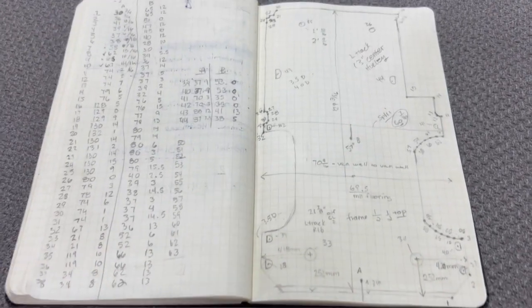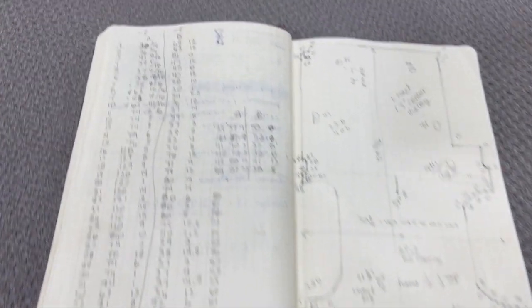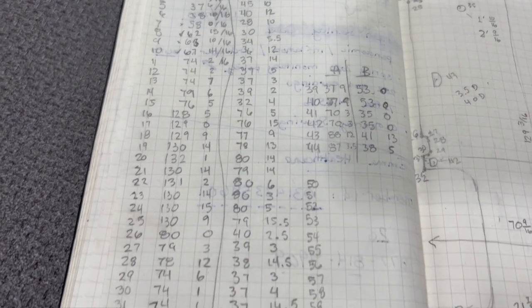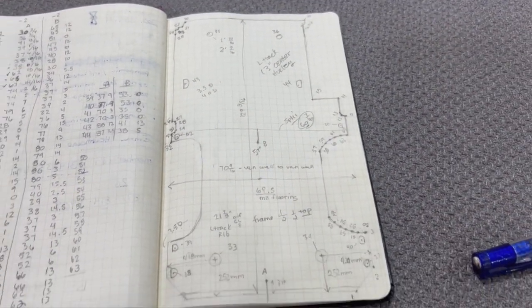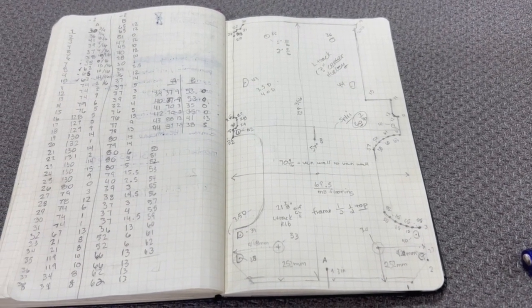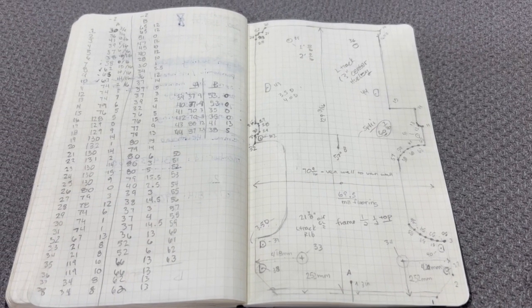Here's the map I made of the flooring to lay it out in CAD. I took a lot of data points — measurements. These are all two inches longer, so I take a couple inches off. I did about 50 points covering the entire floor. By replaying these into CAD, I'm able to basically get a perfect CAD model.